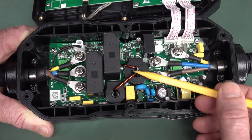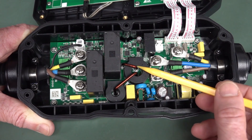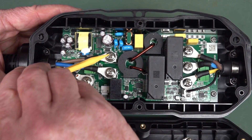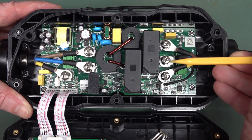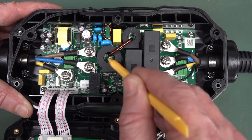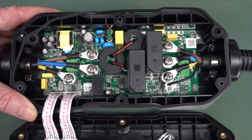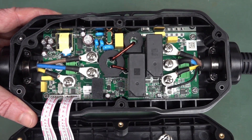So that'd be measuring the charge current, and this one here would be measuring the imbalance between active and neutral — so this would be like an earth leakage circuit breaker type thing. Actually, I had that back to front — this is the output and this is the input. So basically, if the current flowing through the active doesn't come back and is out of balance with the current flowing through the neutral, you'll have a differential between these two. They won't cancel each other out anymore, and it can detect the difference — that's an earth leakage circuit breaker, a core balance relay thing. It will trip and disconnect as a safety feature.